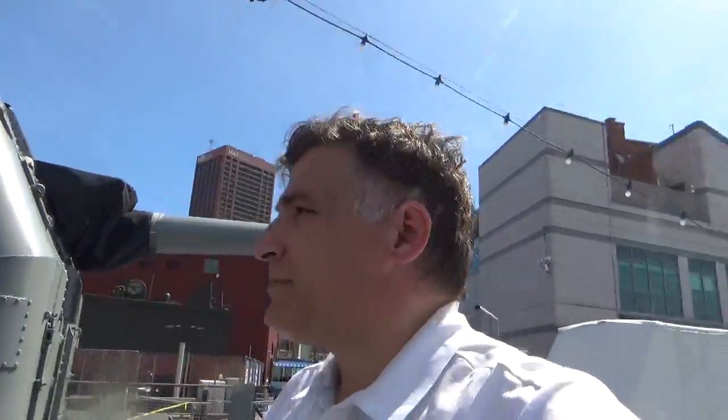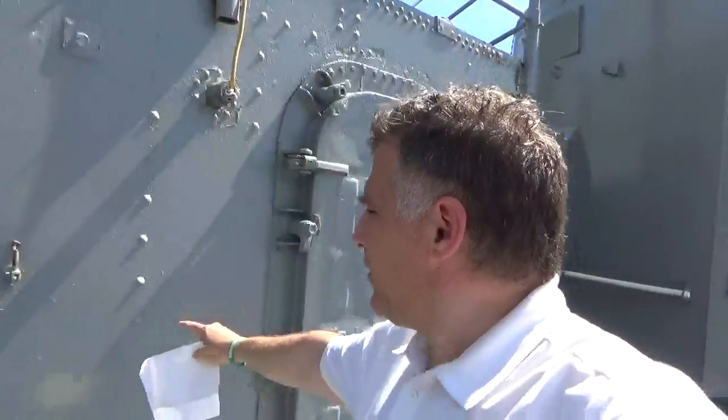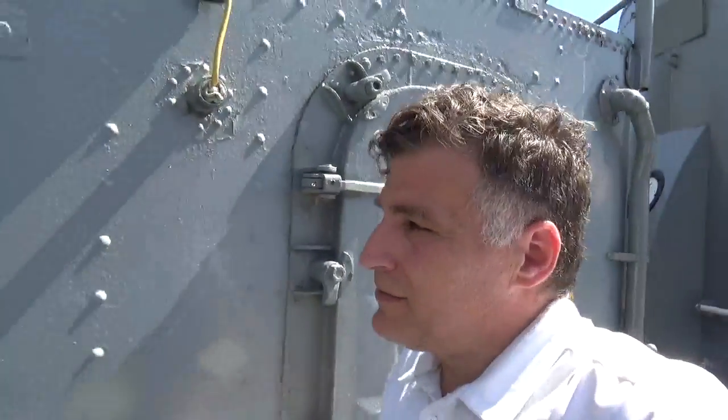So during the interwar and World War II period, the standard and best practice was the midship section riveted, bow and stern welded. For the Sullivans, the main deckhouse is riveted, but then you go up and it's all welded. As you can see right here, there are lots of rivets along here, but going up to the 01 level you don't see them.